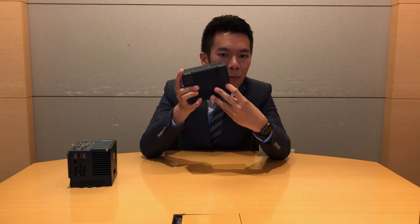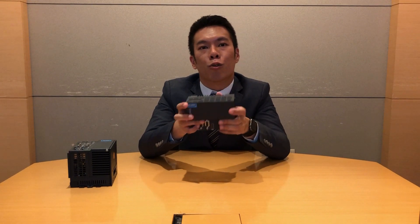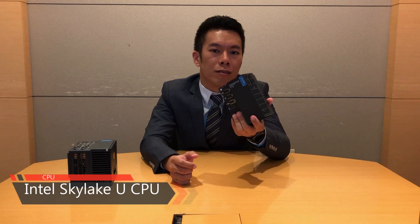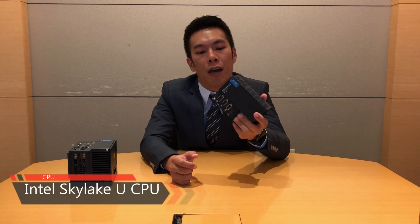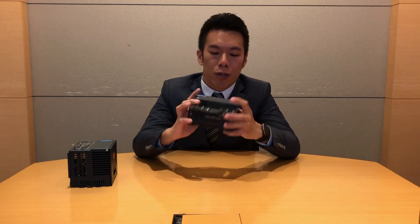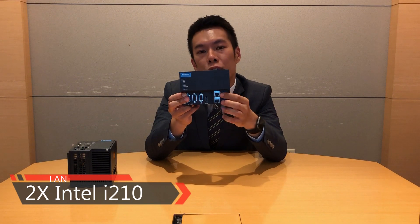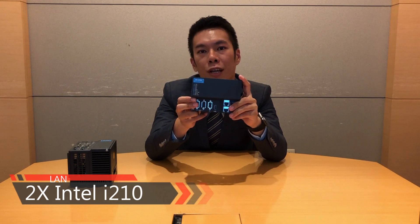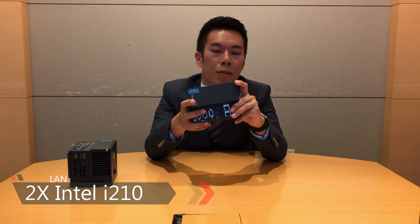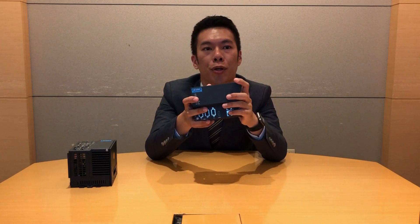Here it also has a mechanical design. The sample I got today is equipped with a 6th generation i7 CPU, which has a 2.6GHz clock rate. It also has Xeon and i3 versions to choose from. We can see here it has two Intel i210 LAN chips, which could be used for real-time communication protocols — for example, in CODESYS with EtherCAT and PROFINET protocols.